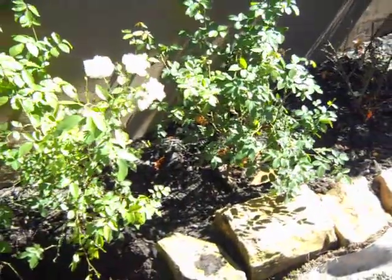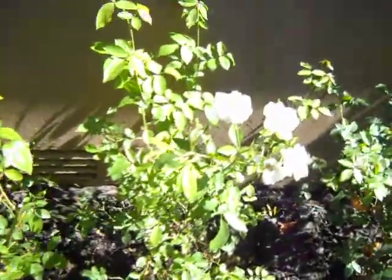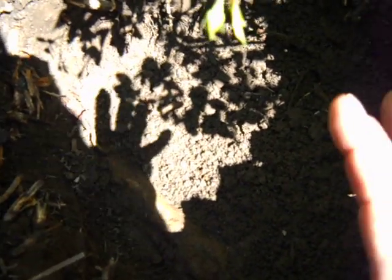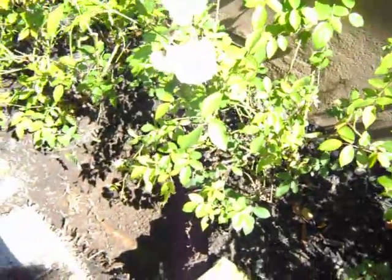But since I'm doing this — this is a very old house, built back in the 40s and it still has the original plumbing. Down in here there's probably about a three-quarter inch galvanized pipe that is corroded and expanded out to about an inch and a quarter with all the buildup around it. You want to be very careful not to disturb that or risk a broken main line. The homeowner is going to have to make a note to replace that in a year or so.